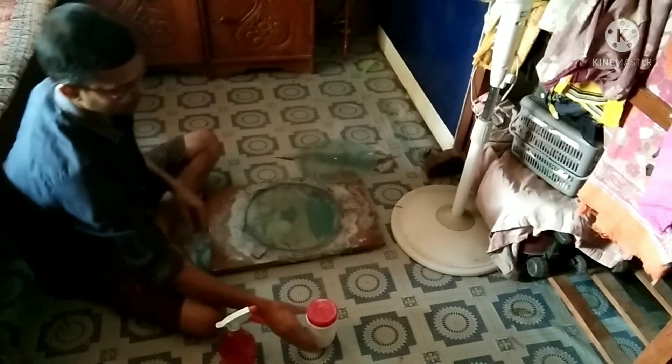Put the mirror over the tool, pouring a little bit of water in between them. You can see a big air bubble at the center — that means the mirror and the tool are not matching perfectly.